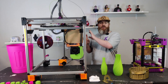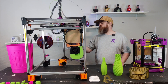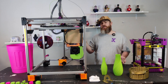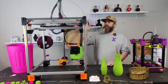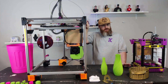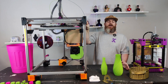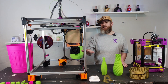For electronics I'm actually using two printer boards from other projects: an SKR 1.4 and an original Ender 3 4.2.2 board, put together with a BigTreeTech Pi — and it performs great. The Creality board doesn't support sensorless homing, which you need for X and Y, so it's only powering the three Z motors. If you don't have spare boards, I'd recommend something like an MKS Monster — nice and cheap — but you need separate drivers and a Pi. Or you can get something like a Manta M8P, or boards like the Octopus. For this you need five motors and an extruder.